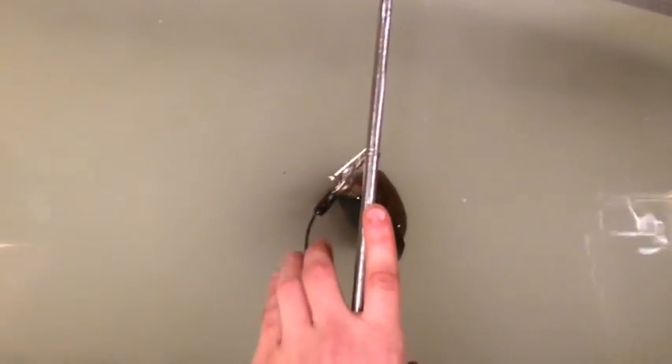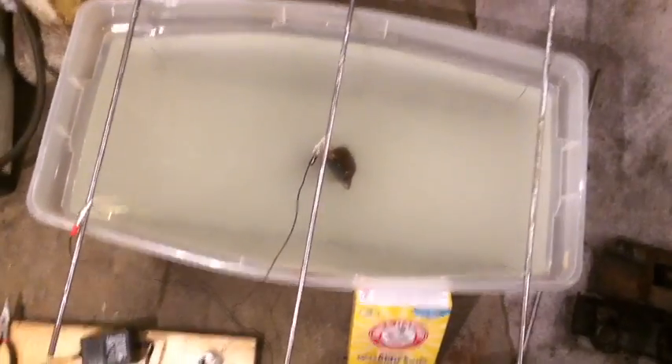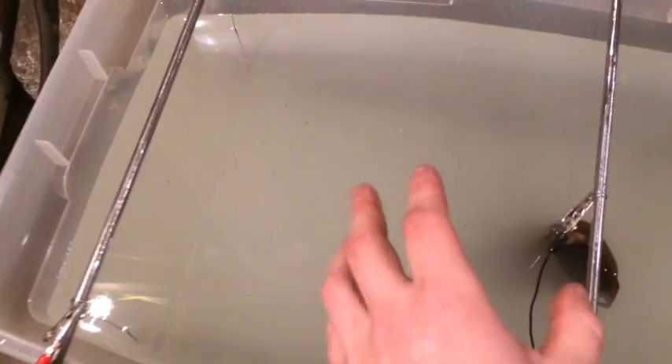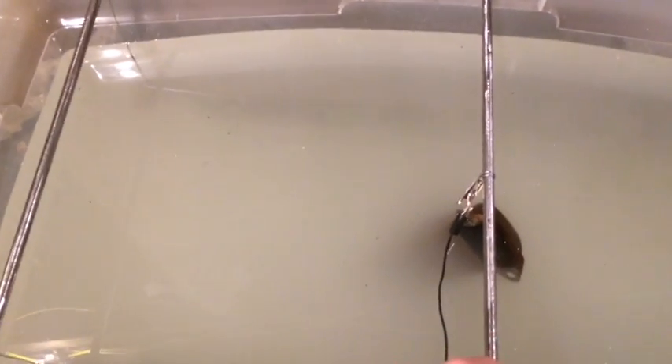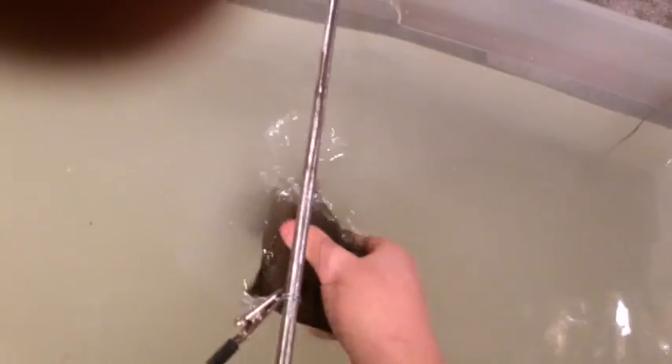So you got a negatively charged piece, and the electrons are going to want to flow from the cathode to the anode through this electrolyte. At the cathode, things get ripped apart - it decomposes particles. On the anode, it oftentimes actually composes particles. For example, you ever hear people talk about anodized aluminum? They just hook their piece of aluminum up to a positive charge just like this, do a controlled run, and it oxidizes the surface of it, giving that nice hard surface finish. There's a reason they call it anodizing - the piece of aluminum becomes the anode. The process also works in reverse: you can strip oxidized things off like rust. This rust is just a ceramic coating - it's iron oxide. When things get ripped apart, the rust is going to want to flow towards the anode.